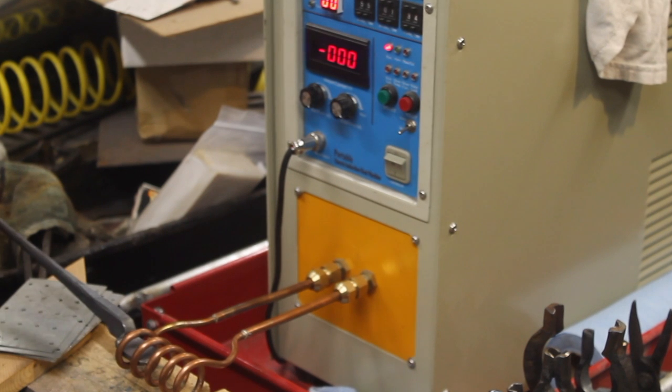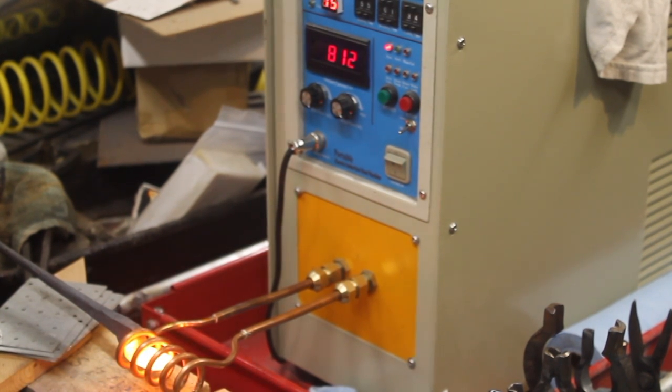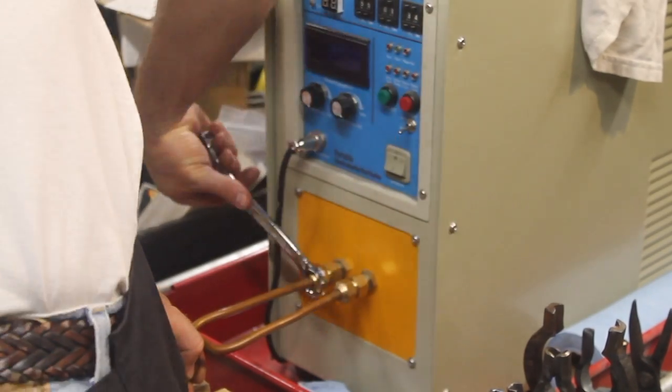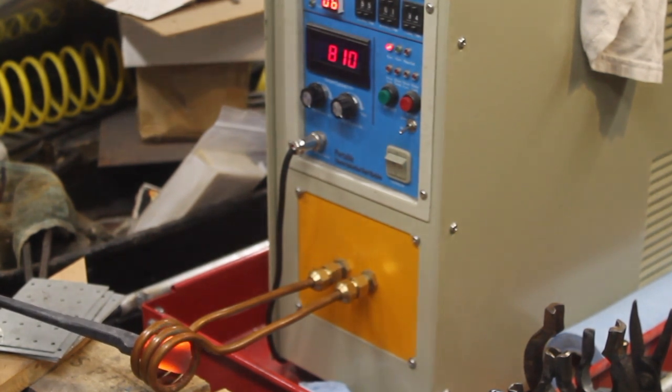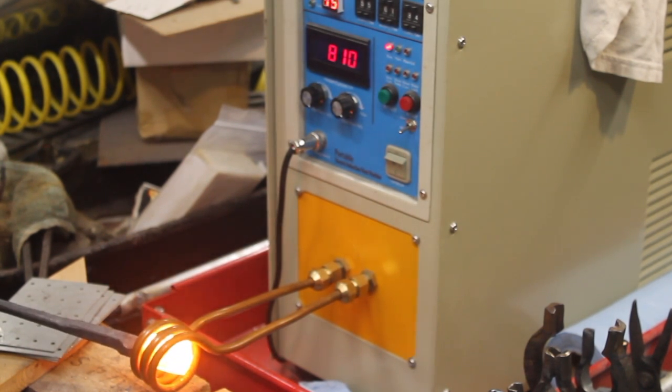Okay, let's try for one more heat. And it's arcing. So this is going to be the last heat — even though I can kind of manage it just a hair wider, I won't be able to keep it from shorting. So now let's turn it off and switch the coil. In some cases, angling the stock not only gets you a slightly longer heat, it actually seems to couple electromagnetically a little better and get you a quicker heat. Keep an eye on the edges of the metal though — they can hit welding heat pretty quickly. Use several heats just like this one to square up and tidy both jaws.